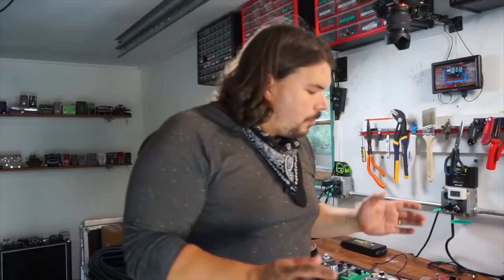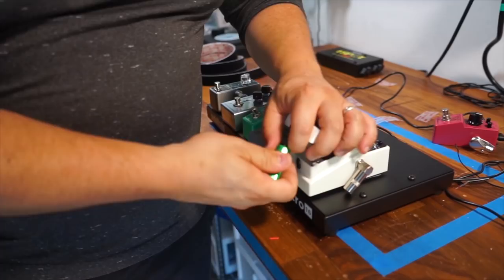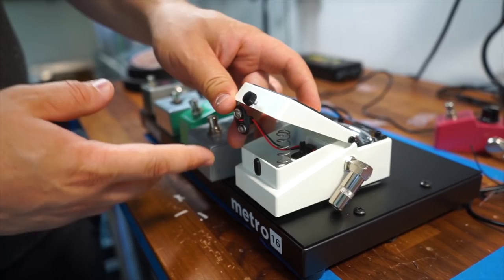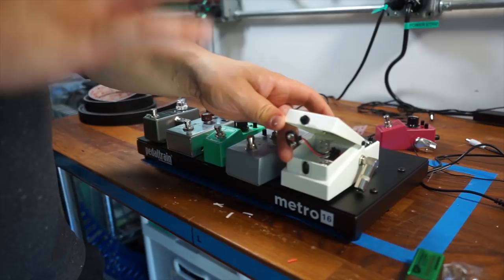One more thing I should mention before I start really getting these guys dual locked down is many of our pedals and devices will come with batteries internally. Now, it's a good idea to make sure that you remove these before you put anything on the board. Not only does it decrease the weight, but it also can prevent a short. I have seen instances where battery clips that are floating freely next to the PC board can cause a short. Now, in this particular case, in the Boss pedal, not so much of an imposition, but on a lot of our other pedals, you'll see examples of battery clips that are open and next to components. This is a good way to make sure that they don't obstruct anything.